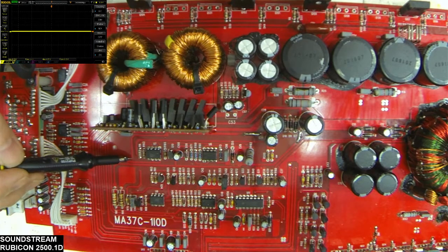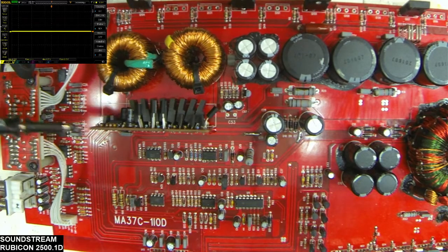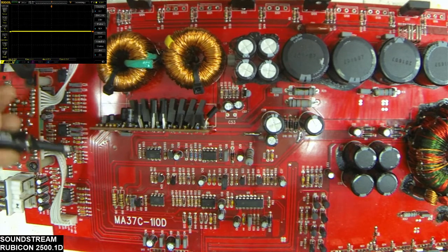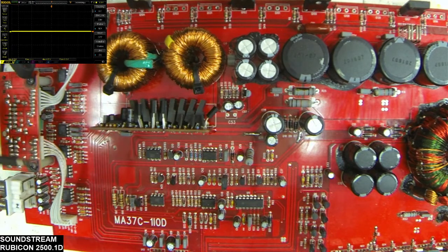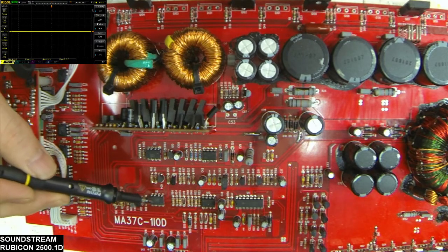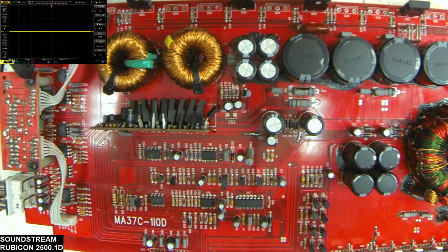That via, when you have your scope here, will get driven to ground. You'll see the scope on the upper left hand corner. I'm going to apply the voltage — you'll see it rise and then drop back down to zero. This will not generate output if this via going to your on pin does not go to ground. This is coming back from U9, so as long as you have an understanding of opto couplers or opto isolators, you'll understand that this pin functions by going to ground, which gives it the on signal.